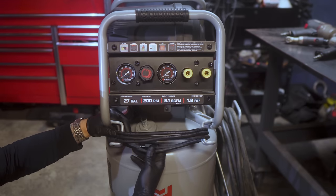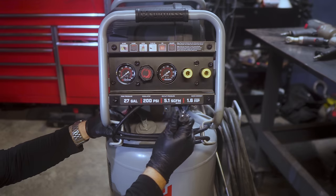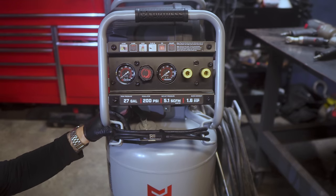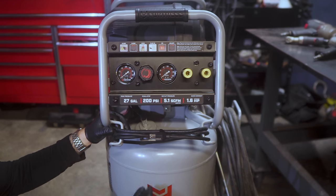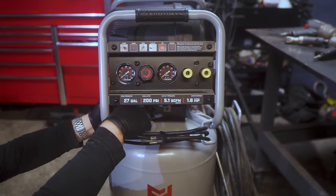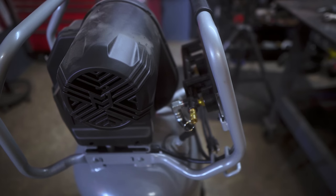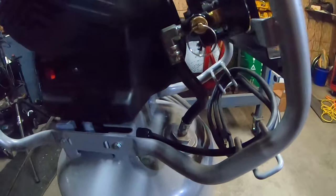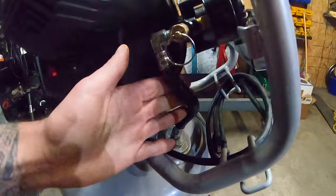The cord is a really thick, nice 14-gauge, three-wire cord with a 120V grounded plug. They recommend you don't use an extension cord, though I've been running it on one since that's all I have. If you do use an extension cord, don't use a really long one or a cheap generic — use a thick industrial contractor extension cord. Behind here we have the pressure gauge valve assembly with all the gauges, couplers, and regulator attached.